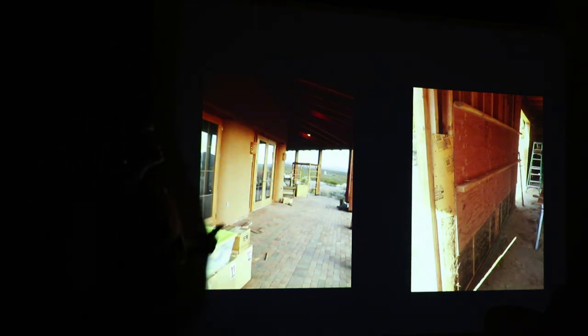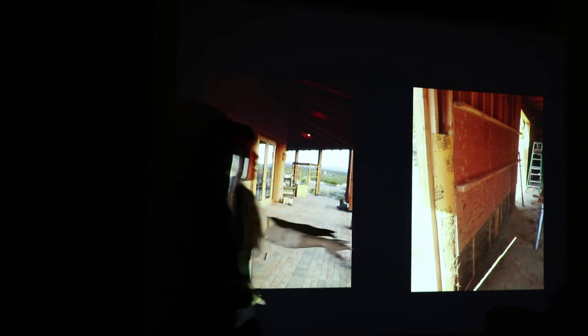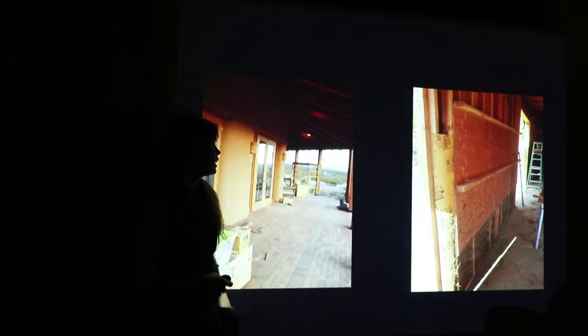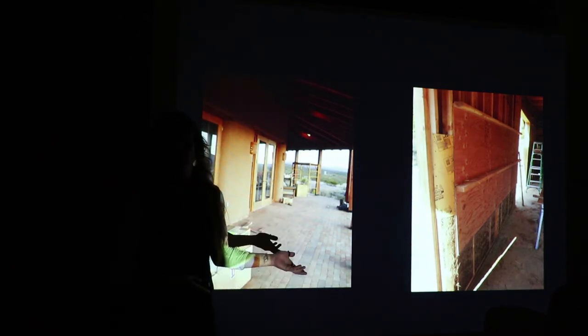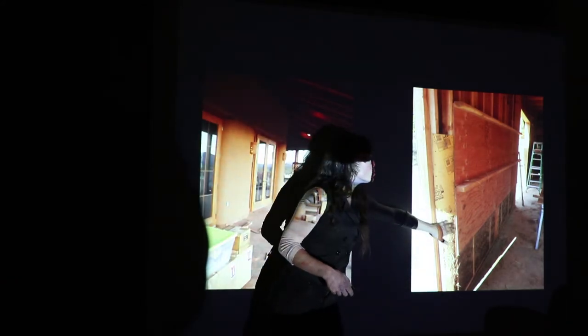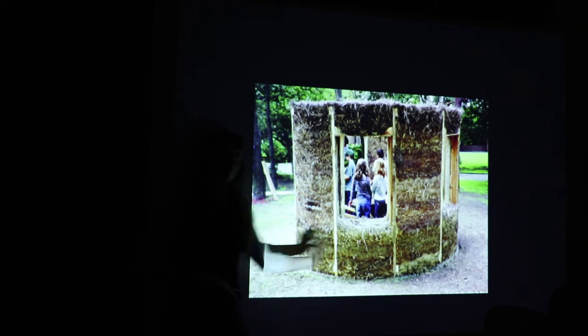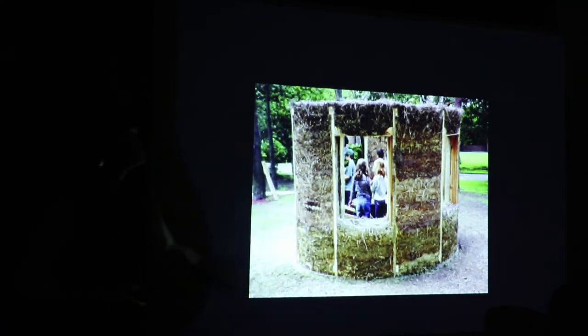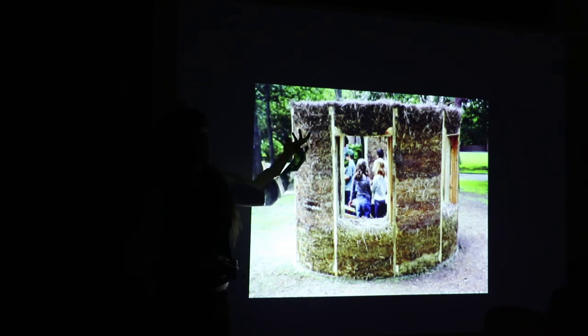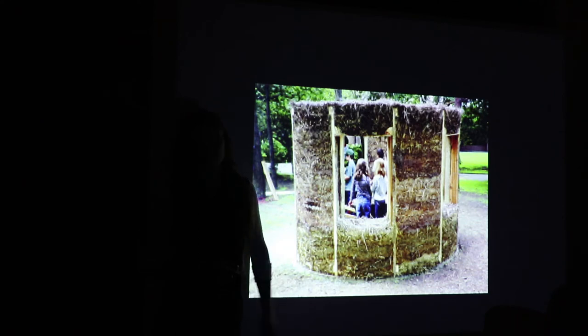Here's some more things because light straw clay is so versatile. There are elements that people feel like they can't incorporate — the curved edges you normally get with cob and straw bale. I wanted to show that here I'm using sonotube formwork and regular formwork in order to get that. You want round? Here's a round light straw clay building. Note that it doesn't have a roof — this is one way to increase airflow so that your building dries quicker.